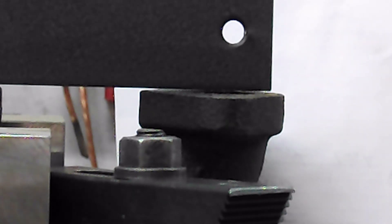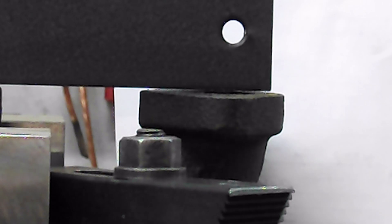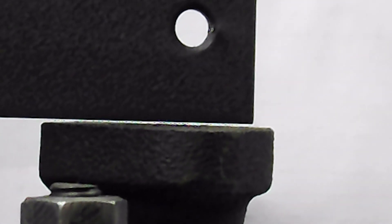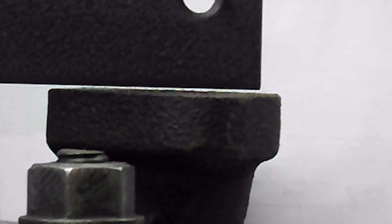Check him out — Tom at Hilltop Machine Shop, he's got some good content on there. Today what we've got is an exhaust manifold off of a Dodge Cummins. And as you can see here, we've got almost an eighth of an inch sitting there hanging underneath. There's a good shot of it — nice little gap. The problem is the exhaust manifold gasket doesn't take care of that.